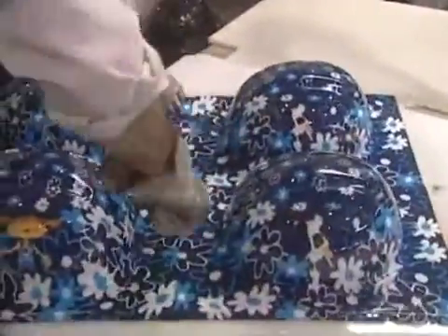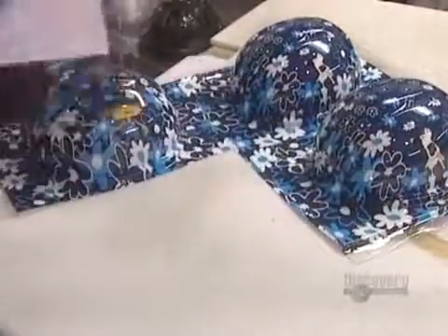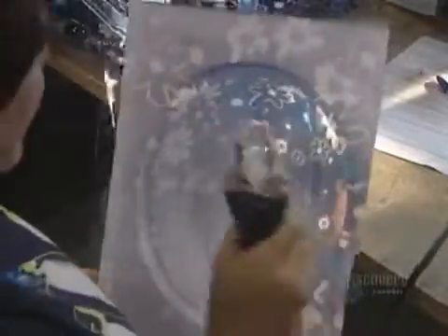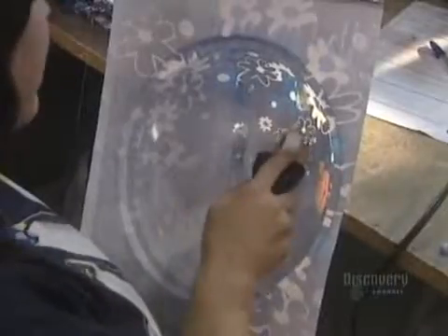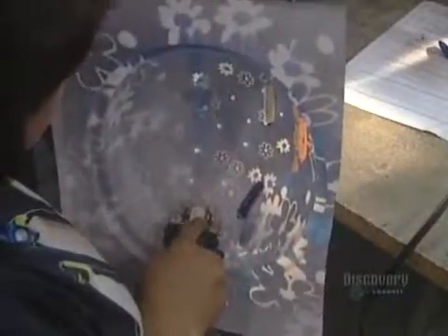Then when cooled down and hardened, the four shells are cut by hand. Ventilation openings are cut with a heated wire apparatus. These openings have been pre-formed during molding of the shell. The heated wire easily and neatly cuts the polymer.